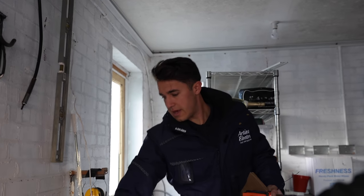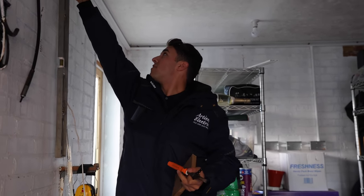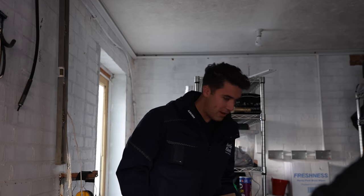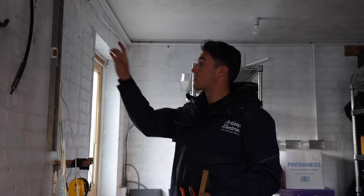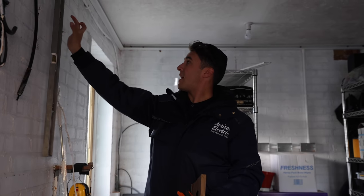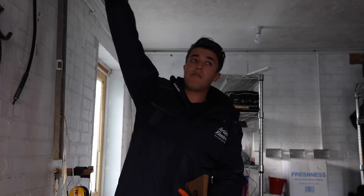I can then run my cables through it. I'll quickly show you that inside — drill a 25mm hole there. Yeah, I can get you a battery or you can just stick that bit in your drill. 25mm hole there, and then the stop end boxes of conduit — drill a hole in the back, mount that there, and then the cable can come through, up and into the containment.